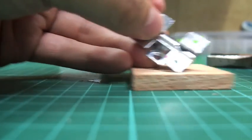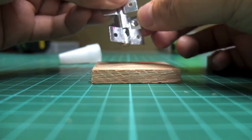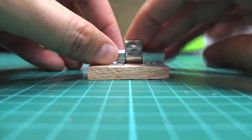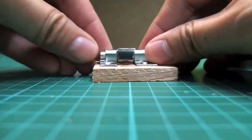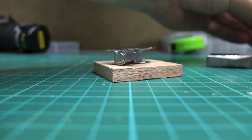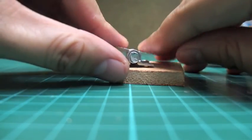Here's a tip: if you're going to do this with the middle part mounted like this, do it upside down so the glue drips outward, because you don't want the glue to mess up the swivel of the center part. Keep moving that one to make sure it doesn't stick. Now let's do the other side — keep it flat on a base like this. Do this part right down there, and one more for good measure. Close that, then wait for it to dry. And there you go — your barrel bolt tilt mechanism.